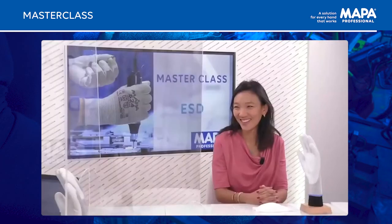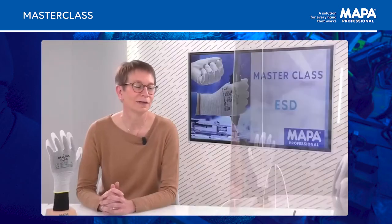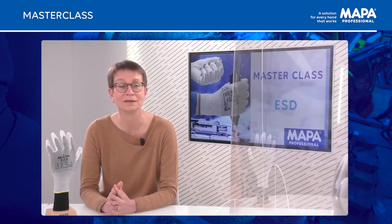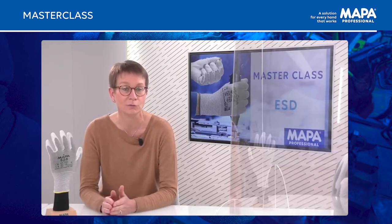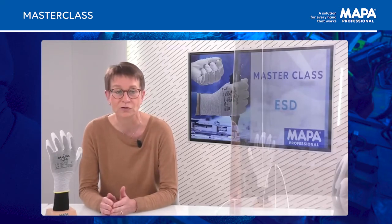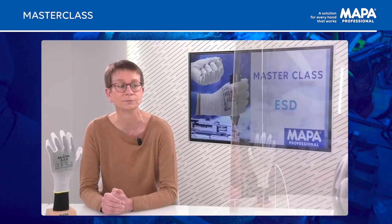Question six. I feel confused by the different pictograms. I believe what you say, but other gloves claim that they are ESD with other pictograms. Whom should I believe? It isn't that complicated. Standards apply to the electrostatic properties of different forms of PPE, be it gloves, clothing, or footwear. All you have to do is find the respective form of PPE and apply the appropriate standard. There is only one standard concerning electrostatic properties for gloves, which is EN 16350.